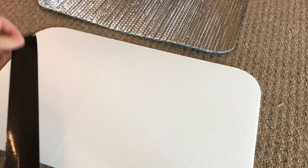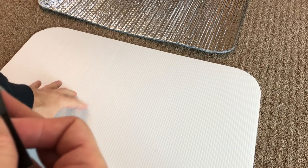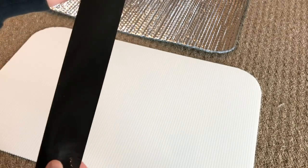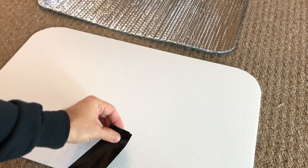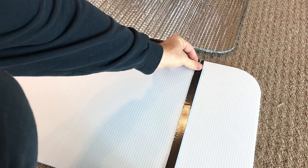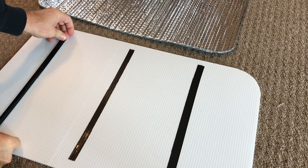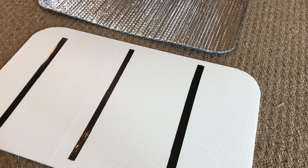Cut out one of these and now we're going to stick it to the board. We still want to have a little bit of air gap wherever we can, but not a lot. The glue gun does not stick perfectly well to the coroplast, but it loves duct tape — in fact, when it has a heat reaction it really bonds quite permanently to the tape, and the tape loves the corrugated vinyl. So I just take one long piece of tape, tear it in thirds, and put three pieces along here. This is a placeholder for the Reflectix to be attached to the vinyl. We don't want spray adhesive — we don't want it completely bonded, we want a little air in there so it can move around, but we want the edges all sealed up.